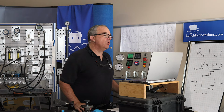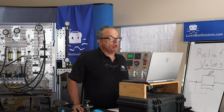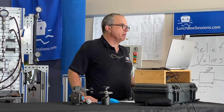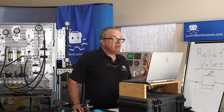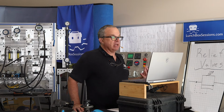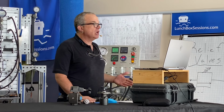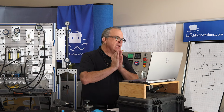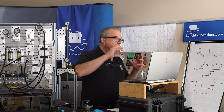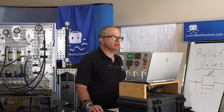Yeah, very good question. It depends on what the normal range setting for this particular component was rated for. The spring will have a different tension depending on what the manufacturer set as the maximum value for this particular component. But if it is a single spring, single poppet style relief valve for a hydraulic system, then it's probably going to be rated for some thousands of PSI, some hundreds of bar of pressure. So if you held that spring in your hand and tried to squish it, it's going to be pretty hard to do. That's going to be a very stiff spring. And that's why it takes that threaded knob there to push against it with that washer and squeeze that thread against the back side of that poppet. Good questions.